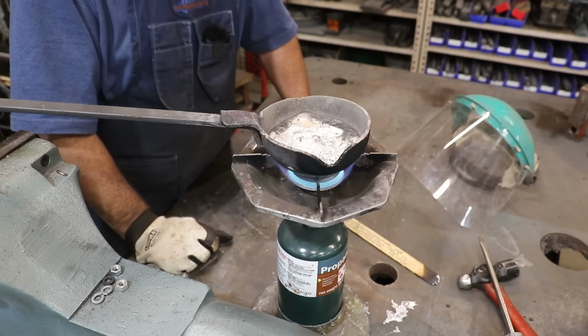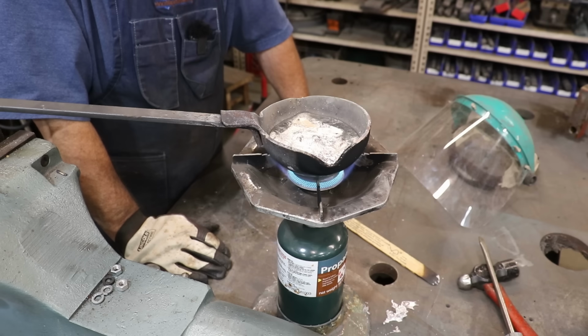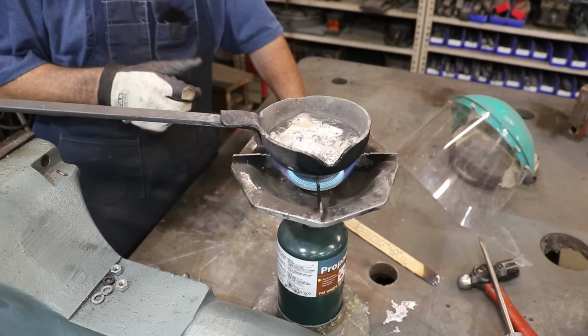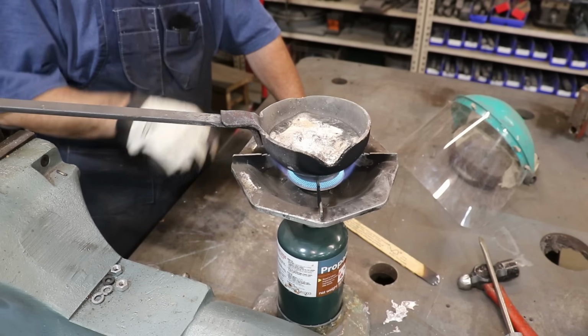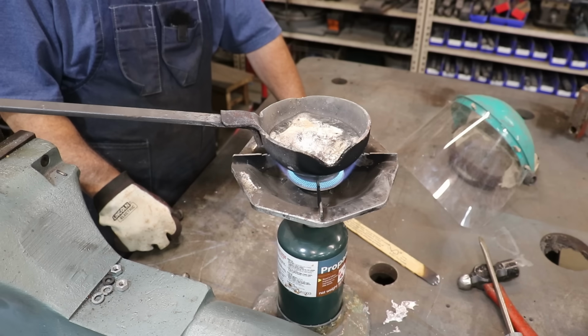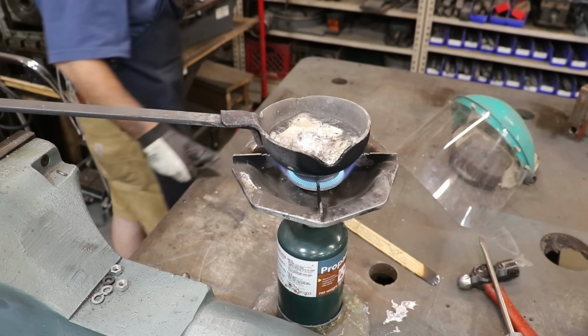And I think I mentioned before, but this is a tin-based Babbitt that we're using. Babbitt comes either lead-based or tin-based. The lead-based is a lot cheaper. The tin-based is more expensive, but I like using the tin-based Babbitt on these cane mills because it is making a food-grade product, and the tin is safe to be around. There's no lead in this particular alloy, whereas with the lead-based alloys, you could potentially contaminate your product with lead from the bearings. It's probably unlikely but possible. This way there's no possibility, and I just feel safer about that.